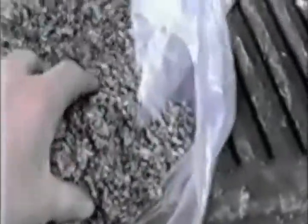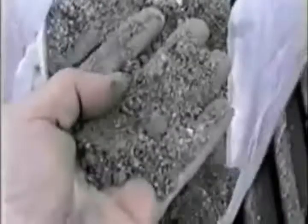What we've got here are the sample sacks from the last two holes drilled. These are the cuttings from the first hole using the standard water injection — this is a D2 Drill Tech rubber tire D40K, six and three quarter inch hole. You can see the fineness of the cuttings and how that bit has to re-grind them due to the available baling capabilities of the compressor. And this is the second hole. You can see there's quite a difference as far as mesh size — the encapsulation is very obvious there.